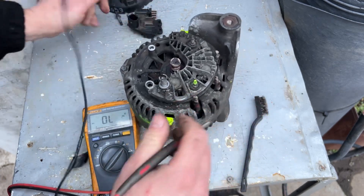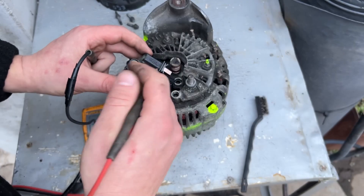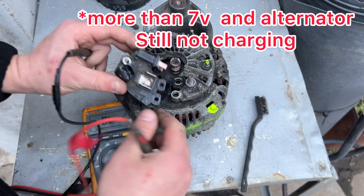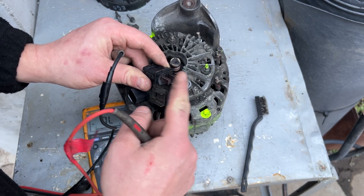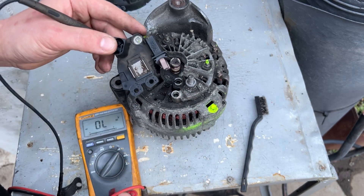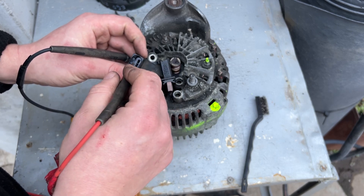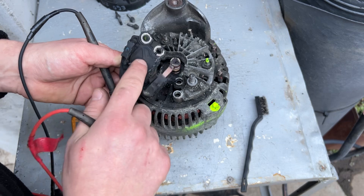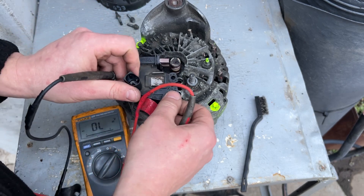This whole thing should work perfectly fine. Now, you still might not have voltage coming and not charging. The last culprit will be this one. What you can do — which is not testing the alternator itself — you can check the voltage that comes to the cable when the ignition is on. If you have 8 volts, it's definitely the voltage regulator. Unfortunately, other than the brushes — you can see these brushes are brand new — you cannot check this voltage regulator with just a multimeter. You need a bench power supply, you need a special communicating device, because some of them use different protocols. Some will expect a signal from the computer, some will expect a voltage between 12 and 14.8 volts. There is a chip inside with almost 15 wires inside, so you cannot check the voltage regulator with a multimeter.